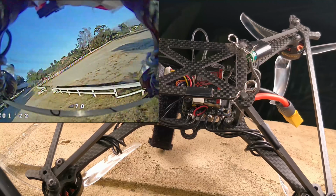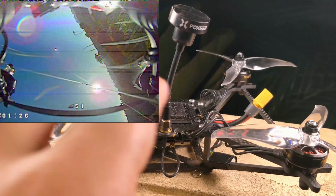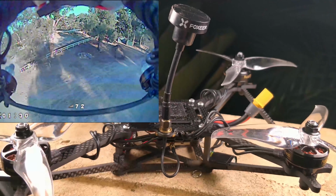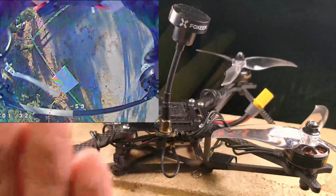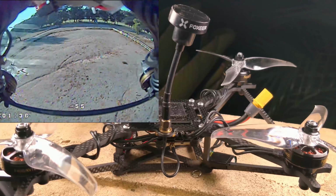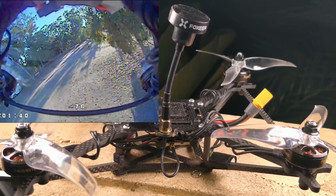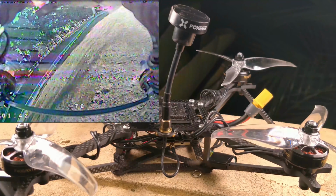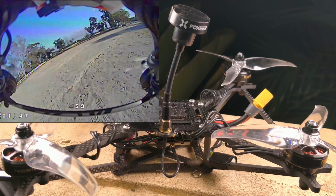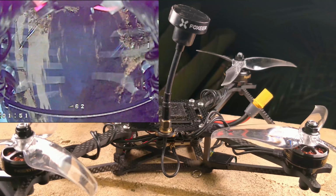So how does this thing fly? If you look at where the battery sits, this is a mid-mount quad. The battery sits right in the middle, and it does have slots for the battery being mounted vertically or linearly, front to back, as well as toilet tank style sideways. And those two do impact performance a little bit. I'm not going to talk about this in this video, maybe in another video later. I prefer the front to back style only because it has a lower chance of getting hit by the props because you can run 2 battery straps.